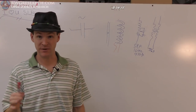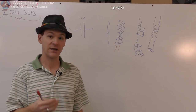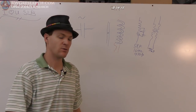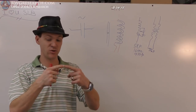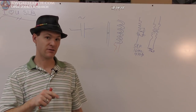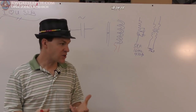Think about it like this: if you have a moving magnetic field, like a permanent magnet moving past the coil with the ends open, you don't see any resistance. The magnet just goes right past the coil with no real interference. But if you measure the voltage at the end of the wire, there is a voltage — the magnet induces an EMF and produces a potential at the ends of the wires. As long as it's open it doesn't interfere.